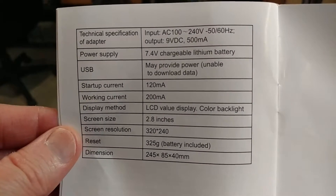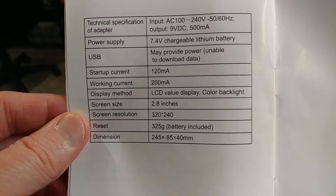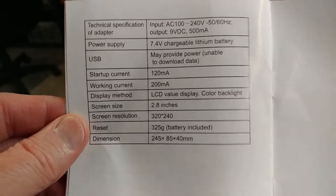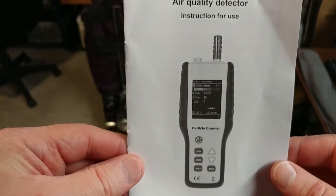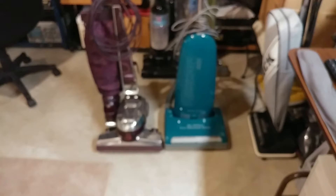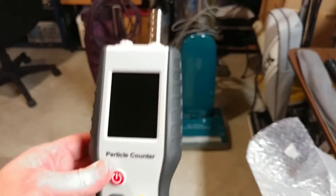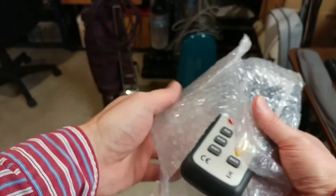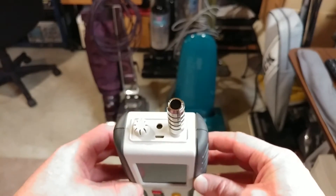It sucks down batteries, it really does. I get professional-grade Duracells and can take probably somewhere between 100 and 150 measurements before I have to replace the battery, and I pay a little over a dollar for the batteries — good enough for me. There are multiple different versions you can get. One of the best things you want to do with your particle meter is keep it clean. When you're not using it, especially in a dirty environment, put it in a bag or a box. Don't just leave it out, especially if you're in an environment with three, four, or five hundred thousand particles. This is a sensitive laser device and I want to keep it accurate.